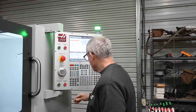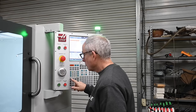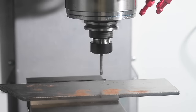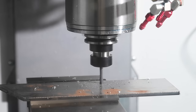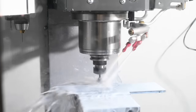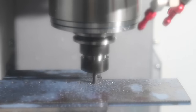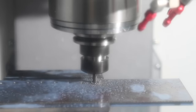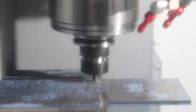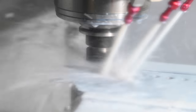Last approach — not relevant to hardly any of you. Clamp hatchet number four in the CNC machine, hit the green button, come back in a minute and it's done. The point here is that I'm actually not drilling these holes at all — I start by drilling a pilot hole, then use an end mill to bore out the rest. I bring this up because you can buy boring heads to attach to manual mills and even drill presses, and if you really need an accurately dimensioned hole, boring is a great way to do it.